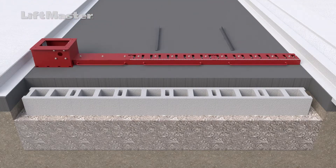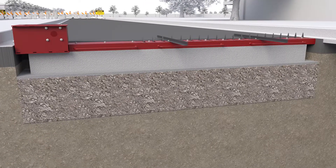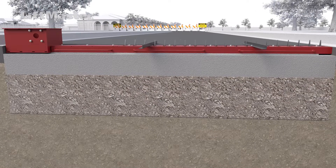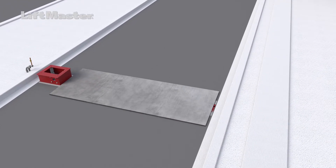Follow the instructions in the manual to assemble the base and tooth sections. To make the installation easier, two lengths of flat or angle iron can be bolted perpendicular to the top plate. These temporary lengths of material will rest on the surface of the roadway, helping the top plate remain level throughout the rest of the installation process. Once properly positioned on the cement blocks, traffic control system sections will be flush and level with the surface of the existing roadway. When adding the mixed concrete, do not allow concrete to enter the body of the traffic control strips, as that will restrict the movement of the spikes and affect drainage. Add the concrete around the perimeter of the strips and in between the blocks, continuing to fill until the concrete is flush with the road surface. For maximum durability and best results, keep all traffic off the units for at least seven days to allow the concrete to cure. At a minimum, keep traffic off for at least two days depending on weather conditions. Steel plating can be used during the curing time to allow continued use of the traffic lane.